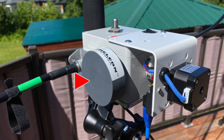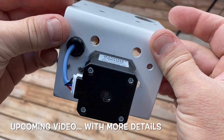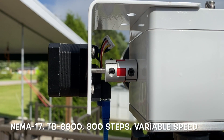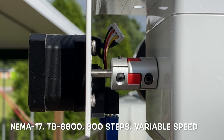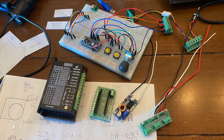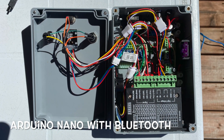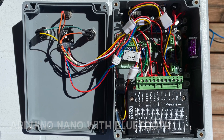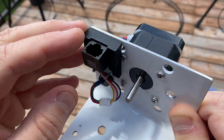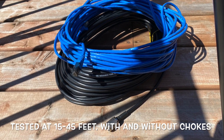The main focus of this video is on the Chameleon Power Compensator, but since I teased you, I will give you a quick summary of the remote controller that will be featured in a future video. It is fully custom-made. It uses a NEMA 17 stepper motor, runs at 800 steps. The microcontroller is an Arduino Nano connected to an overrated TB6600 motor controller. The motor requires 4 pins, and each of the pins are doubled on the RJ45 connectors at both ends, which reduces voltage and current losses.